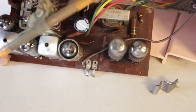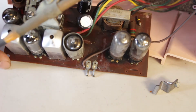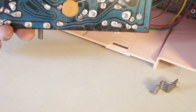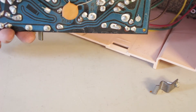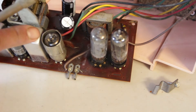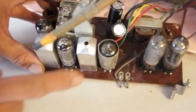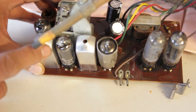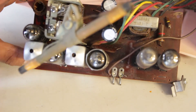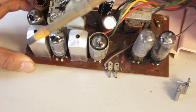You'll see here that these are modern capacitors — these replace the wax capacitors, which are already tossed. There are two here and actually two on the bottom, which I replaced on the bottom because it was easier. That was it — I replaced those three capacitors to get this back to life. These are coils here, from the output of one tube to another, used for transformation of impedances again. And there are some resistors — not too many. I didn't check the resistors; usually they're out of spec, but I've never had problems with them on a radio like this.